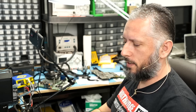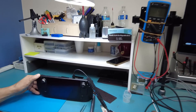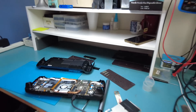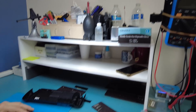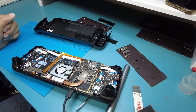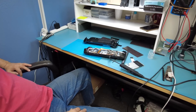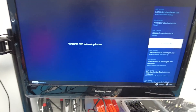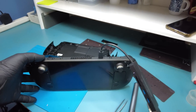I'm handing this over to big boss to reassemble and test. Big boss just finished reassembling the console and said no image is showing up on the screen — we do see a backlight but no image. However, we connected the console to an external monitor and we do see an image there. That tells me we have a problem with the LCD. I asked big boss to remove the motherboard so I could inspect it again, but I didn't see anything obvious with the display circuit, so we're ruling this as an LCD issue.